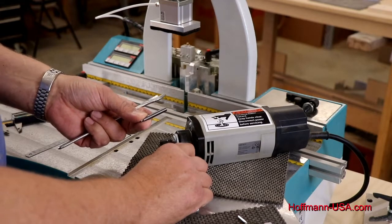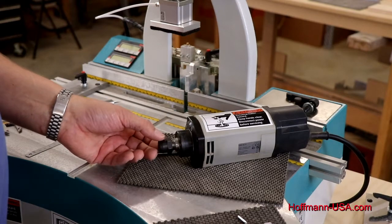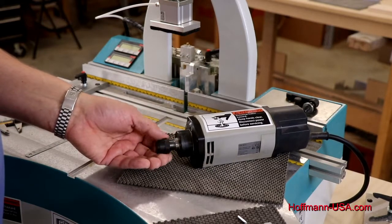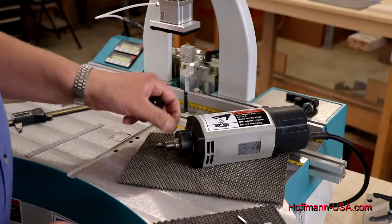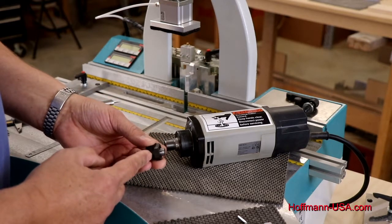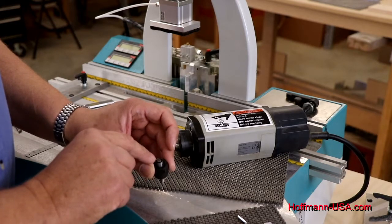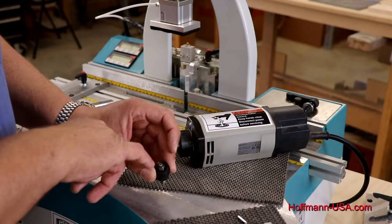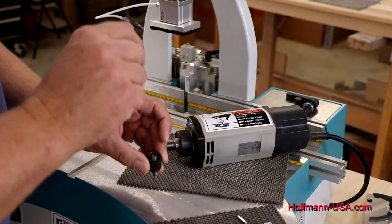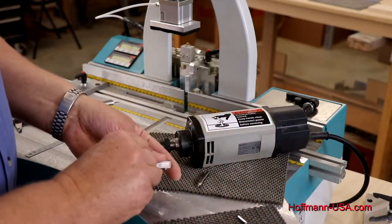You can slide it up and out. If you have not changed a bit in a long time and you find that even after the collet nut is free you cannot pull the bit out, don't put pliers or anything on the bit because you will damage and destroy it. Keep turning the nut until it comes free of the motor. You'll now see that you basically have the bit in the collet and the collet is secured in the collet nut. Set this upside down on two blocks of wood to support the nut and take either a small punch or a small wood dowel and carefully tap on the bit from the back to tap it out to the front. Don't put pliers on it because if you slip you'll damage the bit.